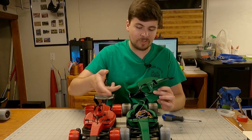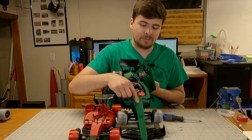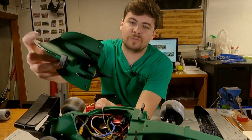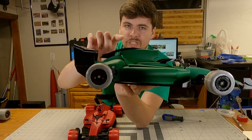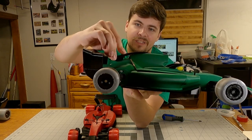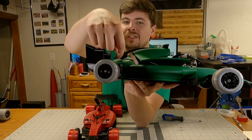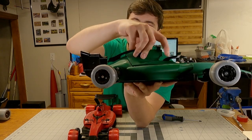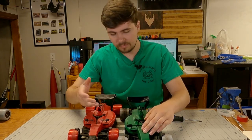It was also modified from the original Noray file to match with the CrackFox halo that I really like. I also modified the original Noray front to allow for the CrackFox halo to interface in a little slot on the front. The biggest area of concern was that when I go to push the lid down, I'm almost clicking it in place — having to bend the fin out to get the lock pin to set in. So I made a modification where I clipped the back edge off the fin to make it a passive piece, so it doesn't actively lock the back down. The lock pin is the feature locking it down, so you're not forced to bend and potentially break it.